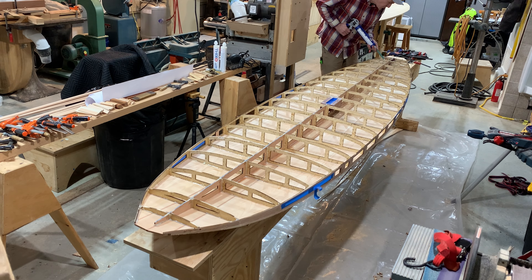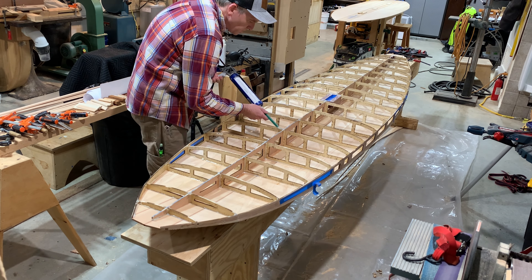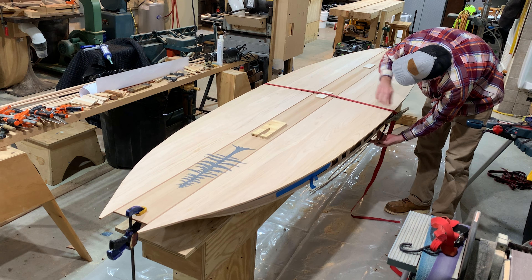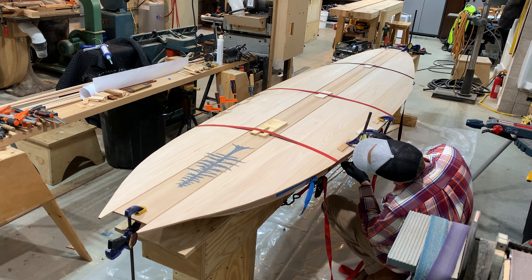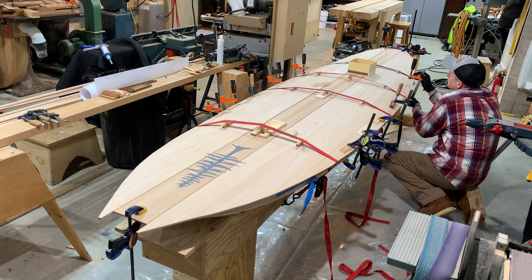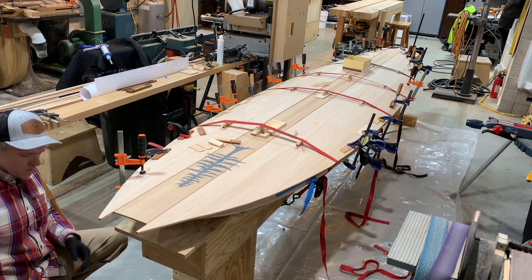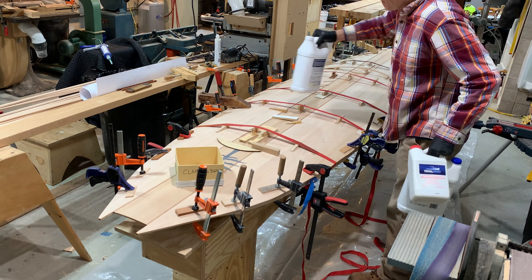I was happy with the fit of the deck — I didn't have any bumps or anything, so I went for it with the Thixo again. This Thixo has a mixing tip that mixes the two parts in one shot, so you don't have to stir epoxy or spread it on — you just shoot it out of a caulk gun and you're done. I use straps just lightly, because my sheets are actually a little oversized. If you clamp down too tightly with the straps, it'll buckle the plywood — you'd probably break it pretty easily. So just light pressure is all you need with epoxy, just enough to contact the frames. I threw some wedges under the straps where I thought I needed it, and then threw a whole bunch of weight down the middle, because it did sort of want to lift in the middle as I clamped the sides down.